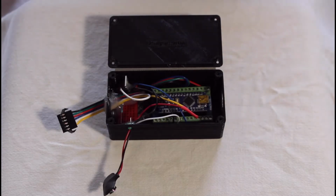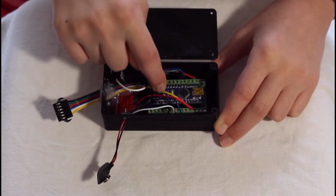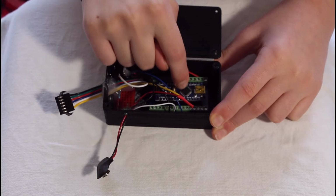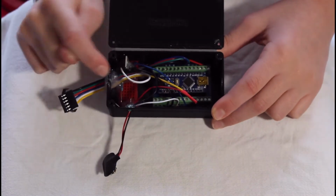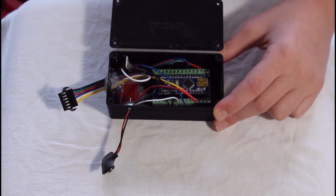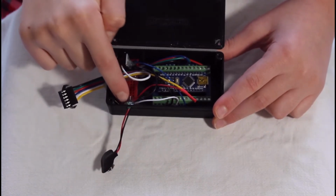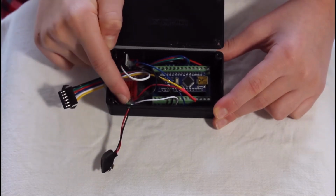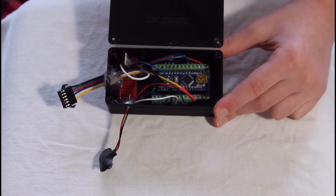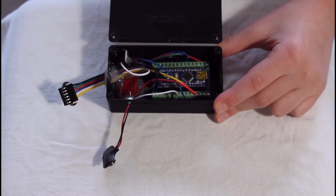Here we have our beautiful project box. Yes, we 3D printed these. Right in here we have a little Arduino Nano, which is the brains of the operation here. And when it detects any form of movement over the threshold of 950, it lights up this LED here, our little indicator LED for debugging, just to make sure, even if our LEDs aren't working, we can still know our sensor's working. Here we have a little MOSFET transistor.